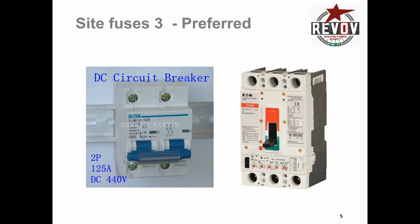By violated I mean you're not going to get some quicker, shorter path or less resistant path from one battery to the other battery instead of all the way up to the inverter. So if you do a point bus bar system, you could be sharing load or missing some of the current that the inverter actually otherwise would see. So please don't use these little bolts here at the top and the bottom as your bus bar. Rather put in a solid bus bar.